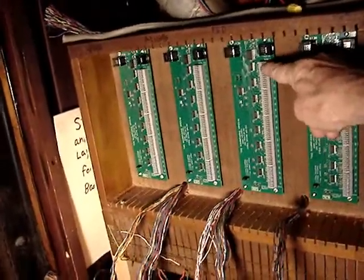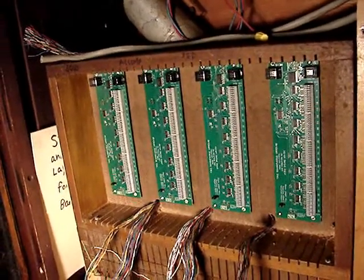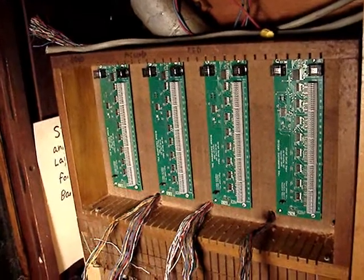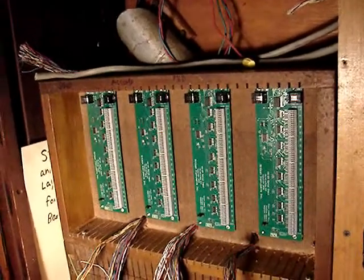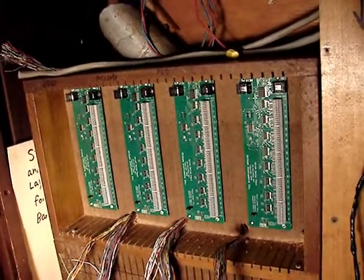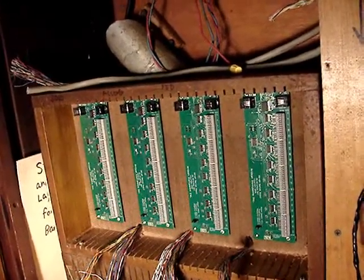Well, this is number one right here. And as I mentioned, the telephone pair sequence starts out with white with blue and blue with white and so forth and so on. The problem with wiring it this way is I got to do that backwards. I got to start with the color pair from 49 and 50 and work down. Now that may not sound like a difficulty, except if you don't think it's difficult, try saying the alphabet backwards, Z, Y, X, and so forth up to A, and see how far you get before you think, wait, what comes next?